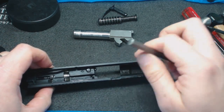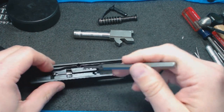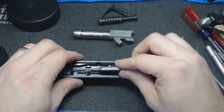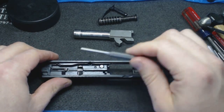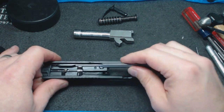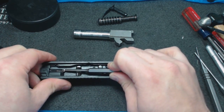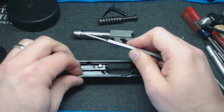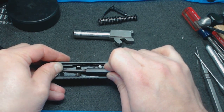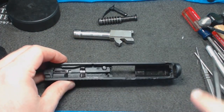And then as the magazine cycles, both of these end up releasing, so that both of them are going to re-engage as soon as the gun cycles. So as it comes backwards off the magazine, first this one pops up, but it won't have actually caught anything yet. And this one's going to stay down as well until the striker catches this again. And once the sear catches the striker, first the firing pin safety should pop up, and then the magazine safety. I did it a little bit too fast, so do it a little bit slower, and we should see the firing pin pop, and then, well, kind of too close for me to demonstrate it, but technically this one pops ever so slightly before this one.